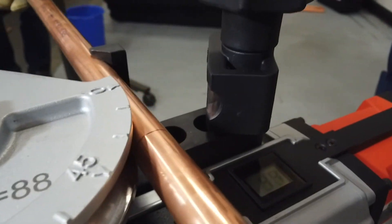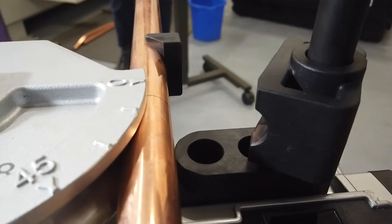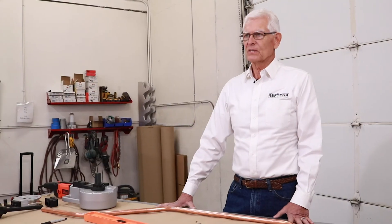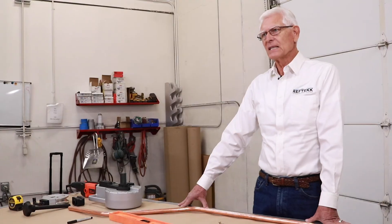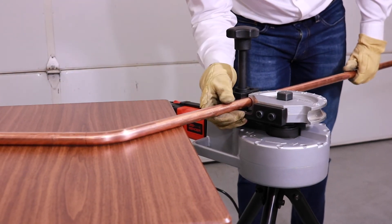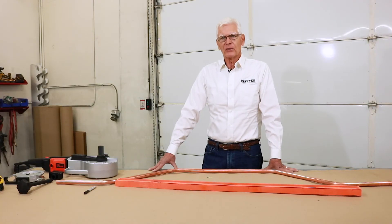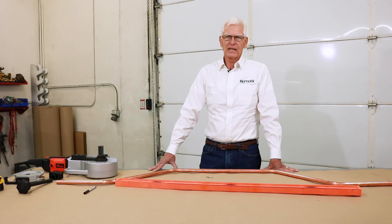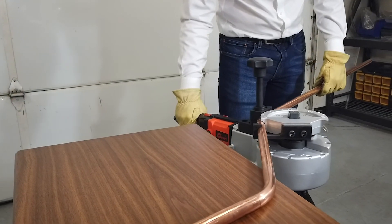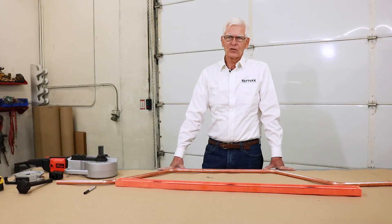Next, move the tubing so that mark B lines up with the zero position on the bending former. We are going to bend all of the angles the same so we will leave the LCD setting at 44. Mark B has an R written on it — remember we put that on there so we would remember to rotate the tube. To keep the bend in the same plane we need to rotate the tubing 180 degrees. This is where you need a level and three hands, or as we're going to do, use a leveling table to maintain the same elevation — it removes the need for your third hand. There is a link below the video to the laptop stand we used as a leveling stand. Once we're convinced the tube is level and in the same plane as the first bend, align mark B with the zero mark on the bending former, pull the trigger and hold until the bender stops. Again return the bender to the zero position going through the two stages of reverse.